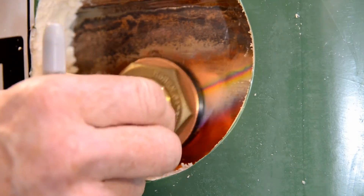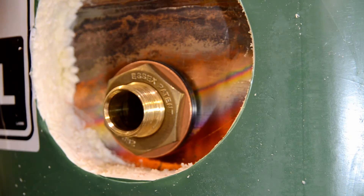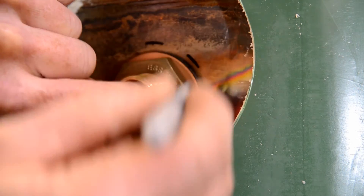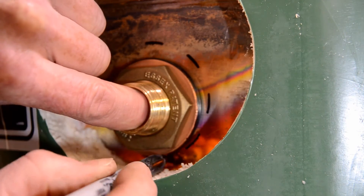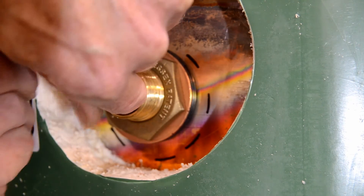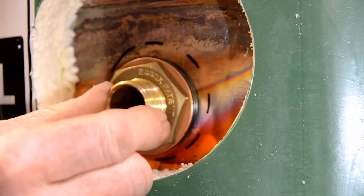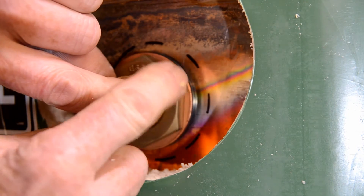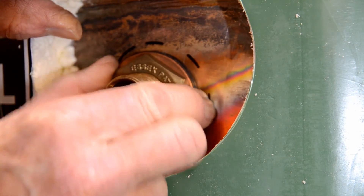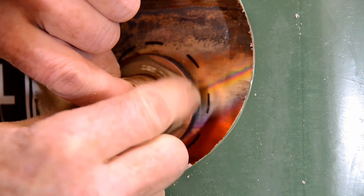I like to know where the centre of this hole is, because obviously you've got a lot of movement. What I do is get a sharpie, take it to the top highest position and mark it, over to the furthest, mark it, there furthest — keep moving it round to the furthest position around the hole. Then you've got a series of marks which enable you to position that fitting pretty much central on your hole, so it's got a good chance of sealing nice and evenly.